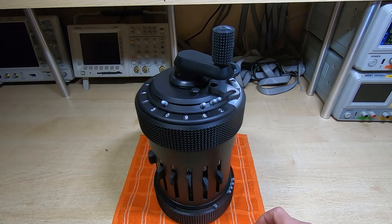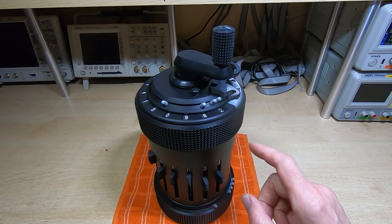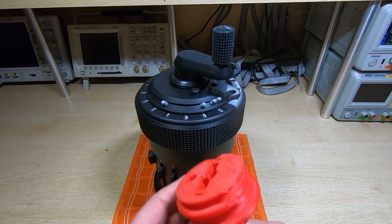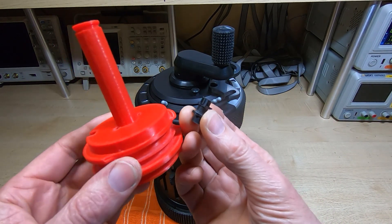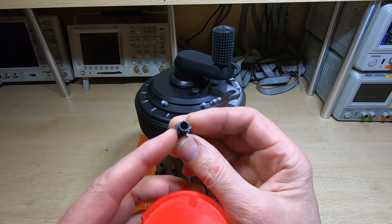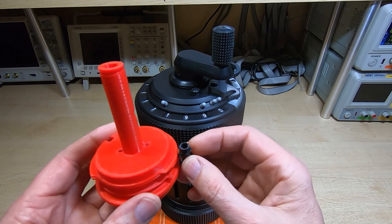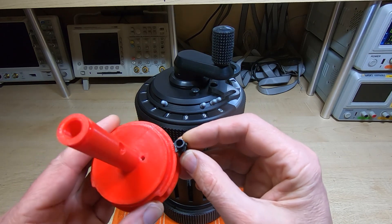The first question was whether I found anything while checking the alignment of the gears. I did find one thing that allowed me to reduce the friction even more, so it now turns even more freely. It was a fairly minor thing. If you recall the tens bell, one of its functions involves gears that run on the drive shafts - there's a locking section of the tens bell that stops the gear turning when it shouldn't, so it can only turn when it gets to the cutout sections. I found this was pressed too hard up against the tens bell, causing quite a lot of friction.